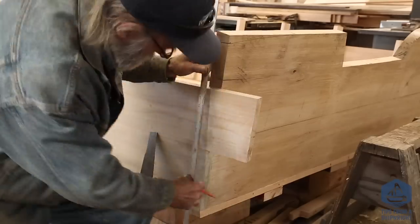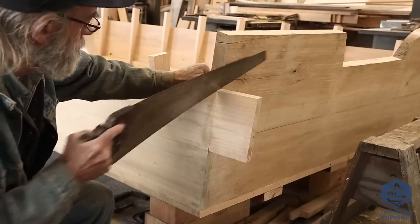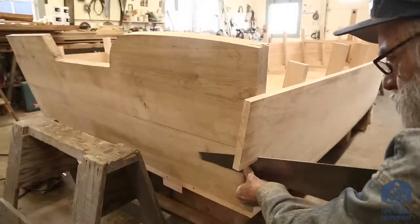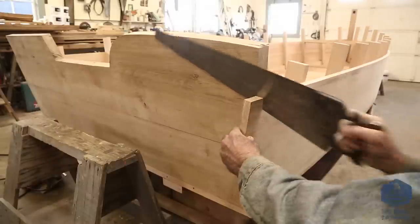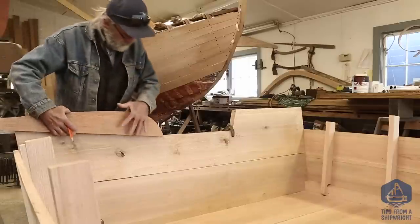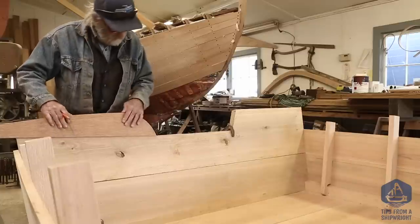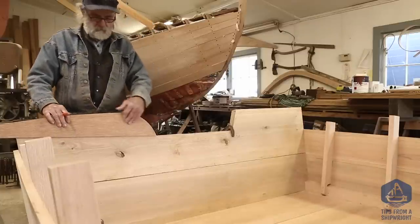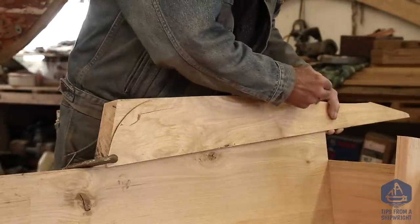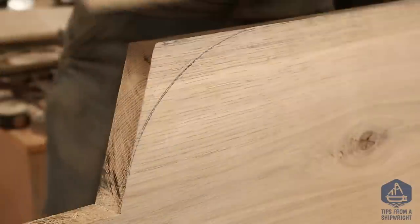Back aft I'm going to cut that second plank that's been hanging past the transom off right now. I left it on there for quite a while as kind of a handle to help when we were flipping the boat over, but it's time to get rid of that. I'm going to make a circular saw cut on the transom and it's been in my way for that. I've got the starboard side of the transom at the top cut to a shape I like - it's got a seven inch radius at the outboard motor cutout and then just a little bit of a slope downhill to the shear line, a little curvature on the top. I've made a template of it in a piece of quarter inch plywood and I'm transferring that to the other side so I can mark it with a pencil.